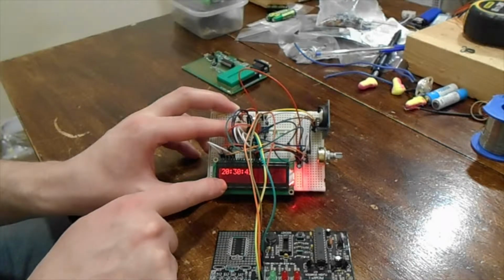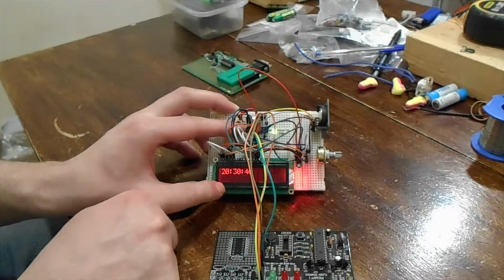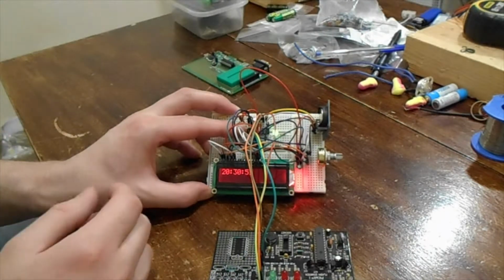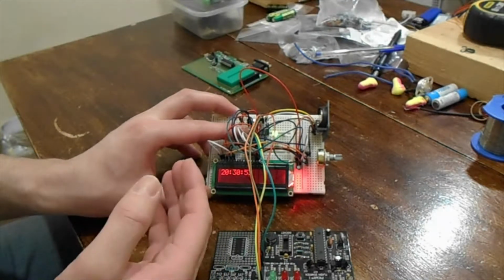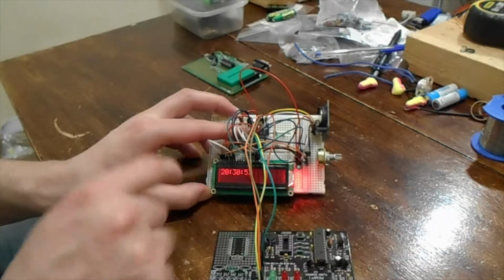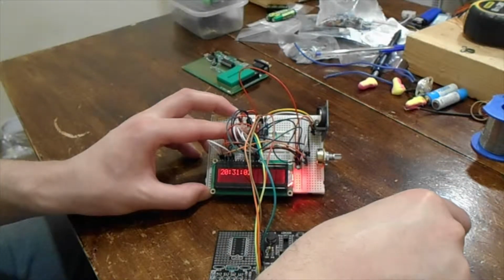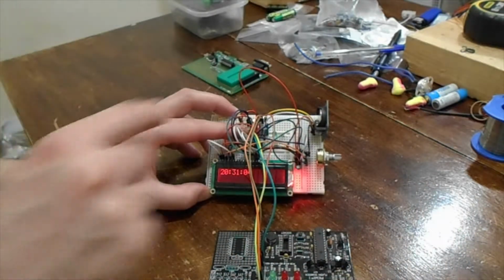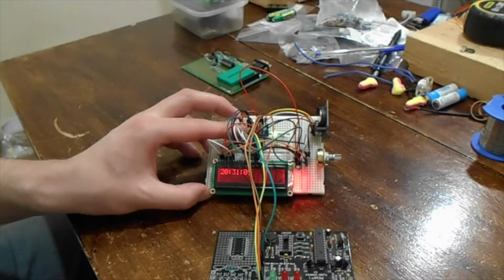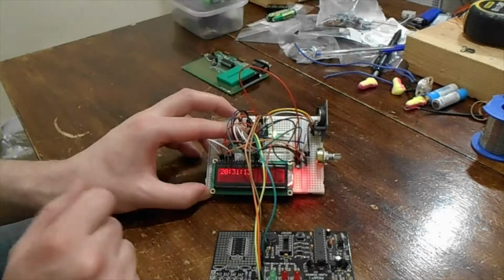The programming to run the clock, which fetches the data and displays it on the screen, had to be removed from the chip, and just the programming to set it was put in. As there are no buttons and no display driver, the only way to set it is manually, in the header file of the program. The first piece of code it executes is to put in the values you wish to set. It takes about 3 seconds from pressing the button on the computer to getting them into the chip, up and running.